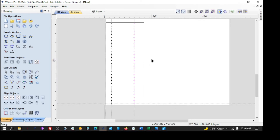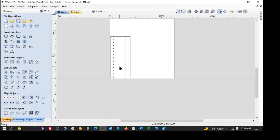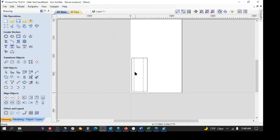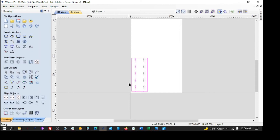That's the left end panel. The right end panel looks just like it except reversed — mirrored. I'll turn off the guidelines. I group everything together so that if I select anything — shelf holes, everything — I can move the whole end panel around the sheet. I take this group and mirror it, flipping it horizontally. It drops right on top of the other one, so I use arrow keys to move it out of the way. This is the front of the right-hand side: 58 millimeters to the holes, 224 from the front.